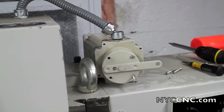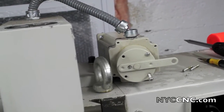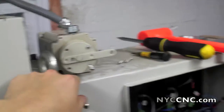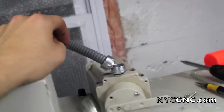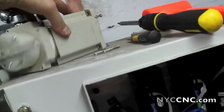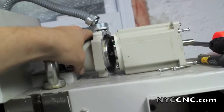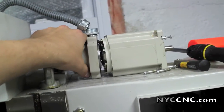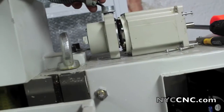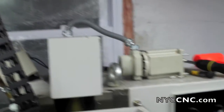Tormach didn't say anything about how to separate the wires from the Z-axis stepper. I assumed you were supposed to disassemble it, so first I took off the brake — that clearly wasn't it. Then I unscrewed the screws on the face of the motor that protrude all the way through and took off the back — that ended up actually removing part of the motor. I have no idea whether that did any permanent damage, but since I'm not putting it back on anyway, it looks like you just cut these wires off right here and tie off to the new ones.